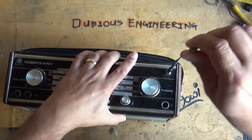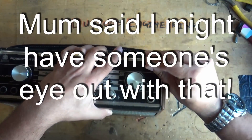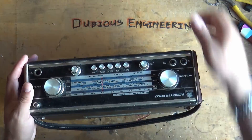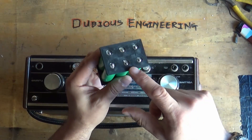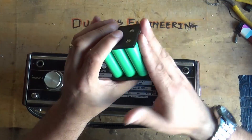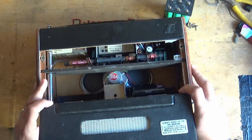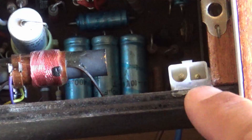Lovely telescopic antenna, tuning knob — everything works. Aside from the fact that you can't get batteries for it anymore. So here's the plan: lithium ion. I've 3D printed a couple of lithium ion holders and the plan is to put a set of lithium ion cells into the back of this. First things first: install some kind of charge connector.